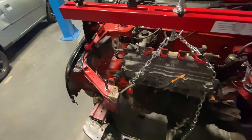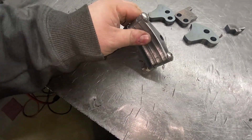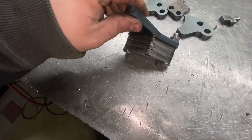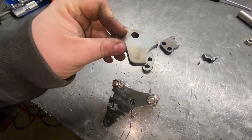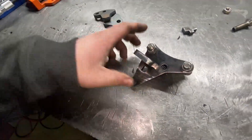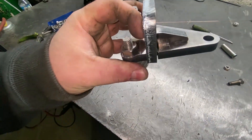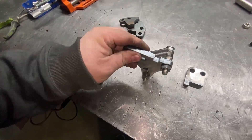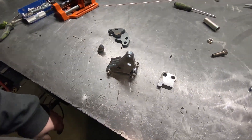I've gone for the laser cutting option. These are the laser cut profiles we're going to be using - everything's cut from 10mm mild steel. It wasn't really cost effective to have this single piece done out of 30mm solid steel, so we've stacked up a load of 10mm plates instead. These are the parts which go onto the actual engine mount casing. The bushing goes on there, and then we've got this little support piece which comes at the back to add a bit of triangulation. With a machined part you have more freedom to add support, but this will do for now. First up, this gets welded - so let's have a welding montage.